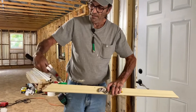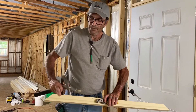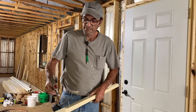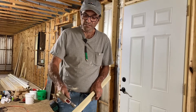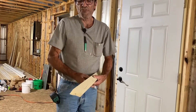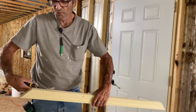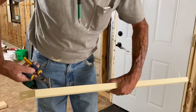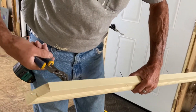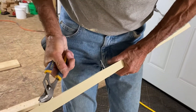It wasn't sunk all the way. What happens when you hammer it through is it blows out the face, and if it happens to be puttied, that comes out as well. This molding is actually an inch thick. So what we do — no matter how thick the casing is, and it's more difficult when it's thicker — is pull it through from the back. You can even take a bigger pair of channel locks, but these small ones work fine. You grab tight, bend, and break it free.